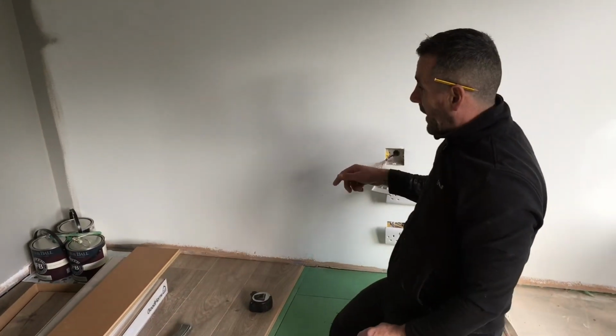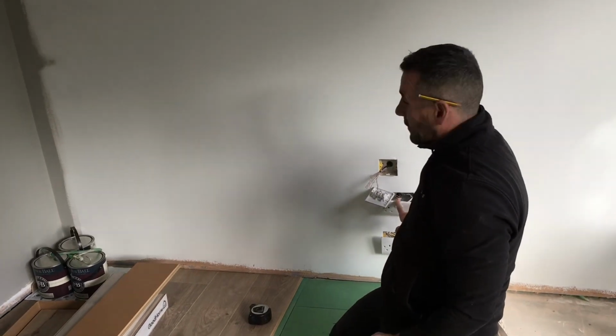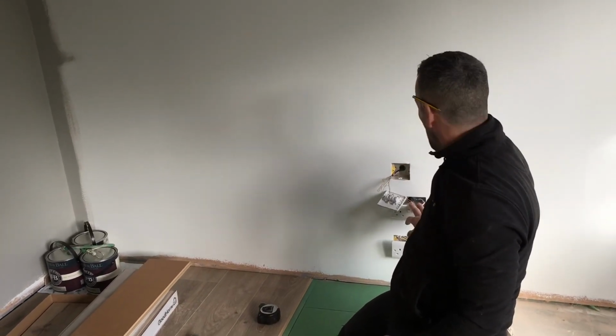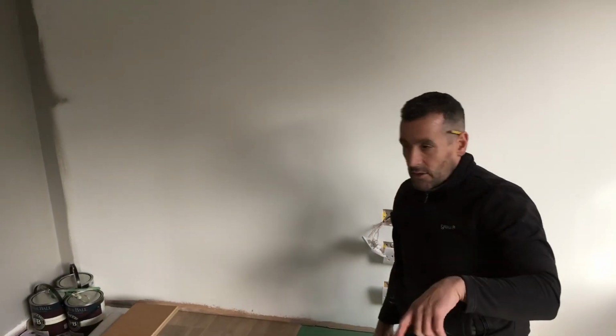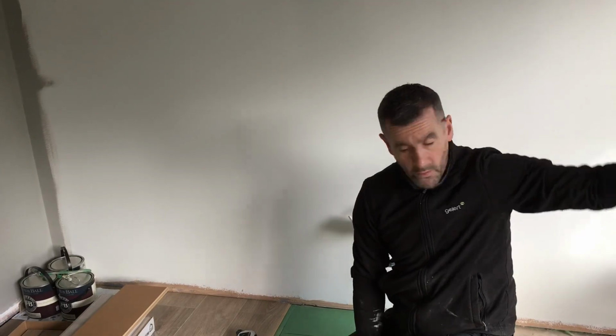So we're going to get the skirting board down today, then we're going to drop the architraves on. Yesterday we started second fixing all the electrics, we've tested all them, they all work. We're going to put Cat 5 on as well, pull the sockets back. John started painting, she's having white ceiling and grey walls in this one. And I will show you how to do the internal mitres on these skirting boards, and I'll show you how we reveal around the windows as well and put the architraves on them as well.